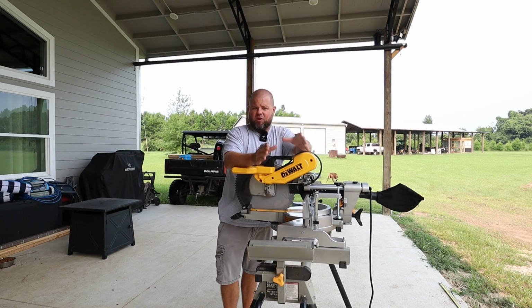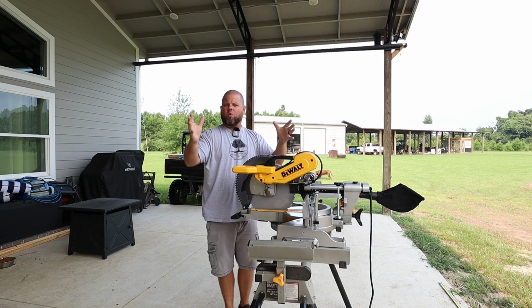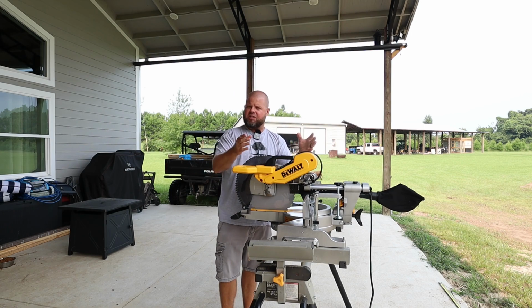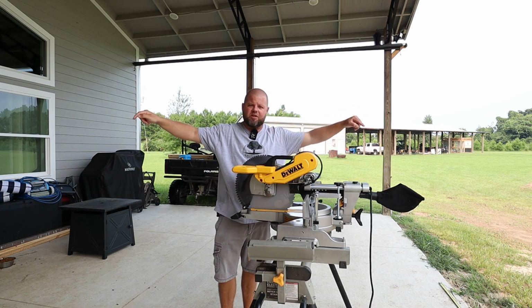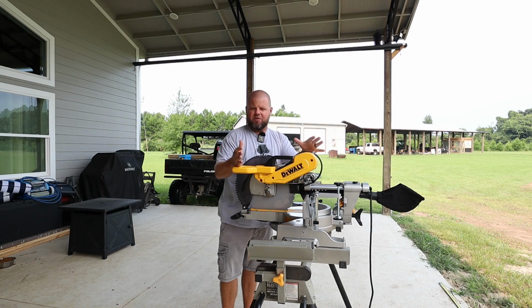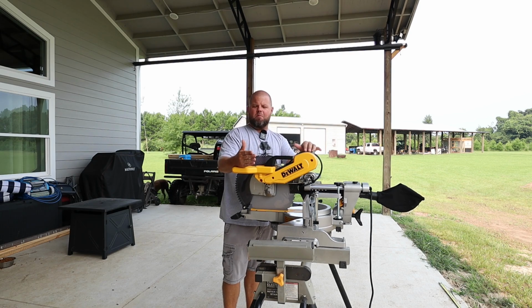Well, we're going to have to be really critical because we're going to have posts laid out in all different areas. When you're laying out a square or rectangle type barn, like what you see behind me, it's much easier to pull one string line and set your post. But when those string lines are going to meet a certain area and then take off in a completely different direction, well, we have more setup time with that. So that's leading us to the most critical step of part one right here, setting up our batter boards.